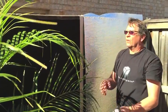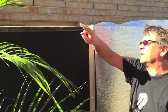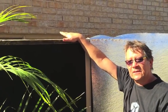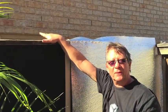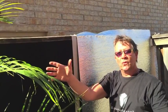It's all good behind this fence, but above it the sound will travel above and I've got nothing to stop the sound there. That's why the sound absorber is quite important, because sound is a wave. As the sound goes over, it will get partly absorbed by the sound absorber on the fence, so it will be much weaker at the top of the fence. That's why we combine sound barrier and sound absorbers.